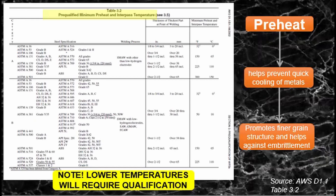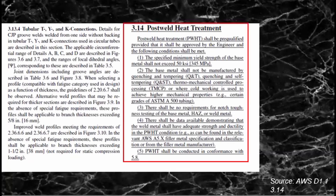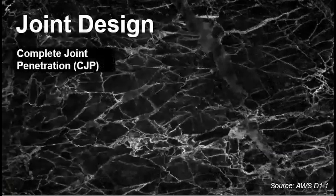For the maximum interpass and preheat temperatures, you will need to note the specific metals you are welding. For post-weld heat treatment, there are guidelines in Clause 3.14, which are pretty much self-explanatory — there is a limit on minimum yield strength and limits on how the base metal is manufactured, to assure that the metals are not too brittle and to ensure ductility at the PWHT condition. It shall also follow Clause 5.8 of AWS D1.1.